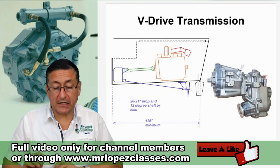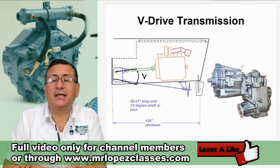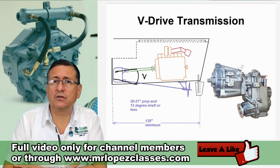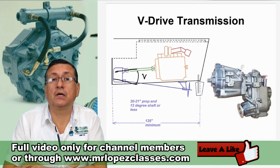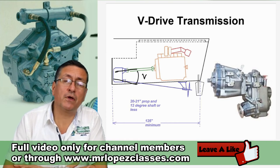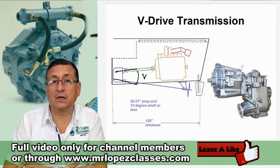This is a perfect example of the V-Drive: one input shaft, one output shaft, and this is the V-angle. There are many advantages of that system and also some inconveniences, but depending on the space you have in the engine room, the V-configuration is a great solution. You can order the same transmission as a straight inline transmission or a V-Drive, with the same gear ratio. The majority of manufacturers produce both in series with the same gear ratio.